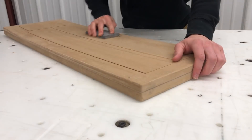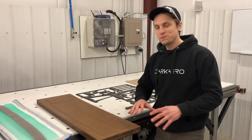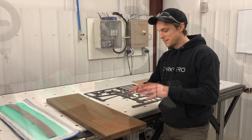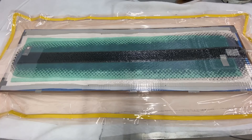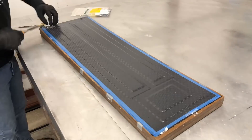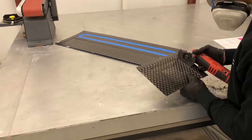With the mold fully machined, we sanded out the tooling marks and then added an epoxy coating followed by mold release. Since we are anticipating making tweaks to the doors, we shortcut to a prototype MDF mold for now. With the mold completed, I got our infusion materials together and infused the carbon fiber with resin. Once the gear doors were cured, I demolded the carbon fiber from the mold and cut the nose gear doors out.